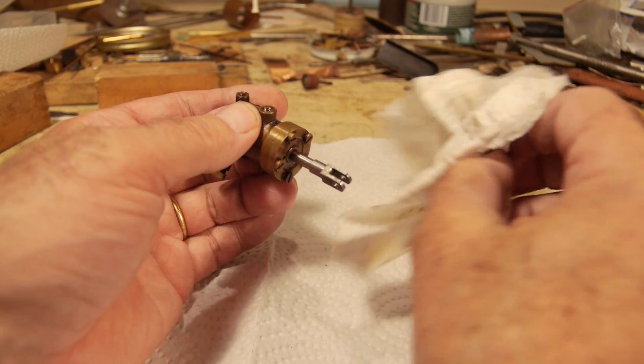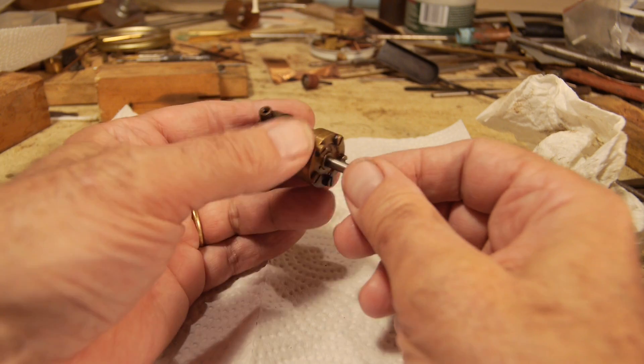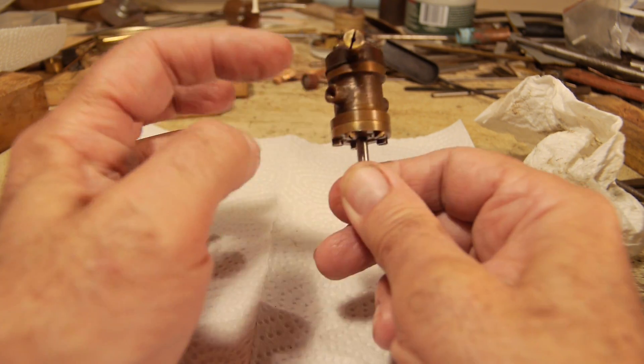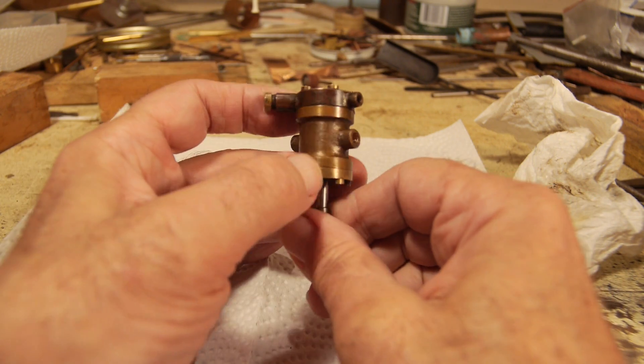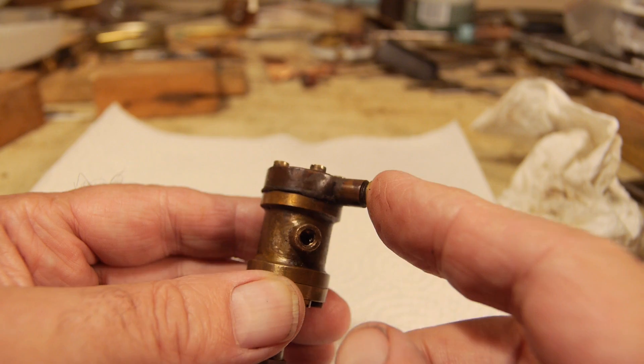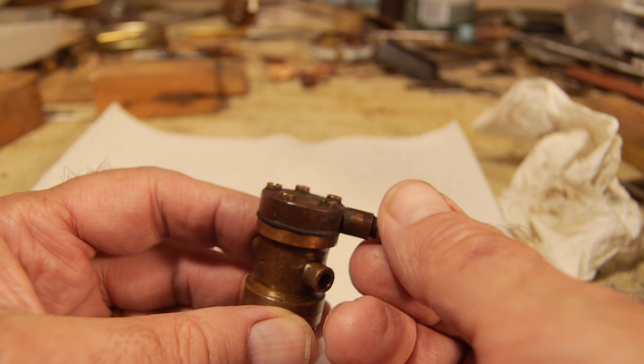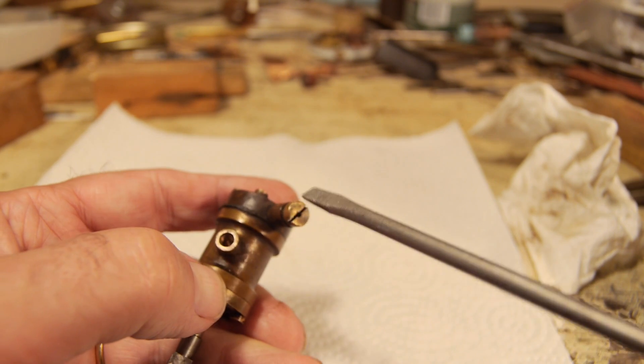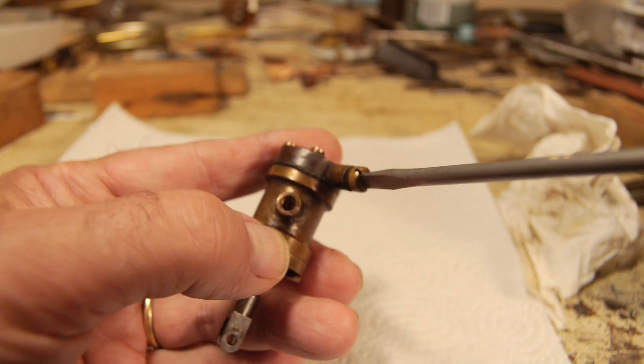When the pressure builds, this ball valve closes and then the steam actuates — all of that happens within a fraction of a second. The cylinder has a spring at the end so it self-returns, and it's got an O-ring in it. Hopefully I don't need to take the cylinder head off, but I need to look in here because this is where it was passing steam out and not actuating — the ball valve got stuck. So let's take this off.